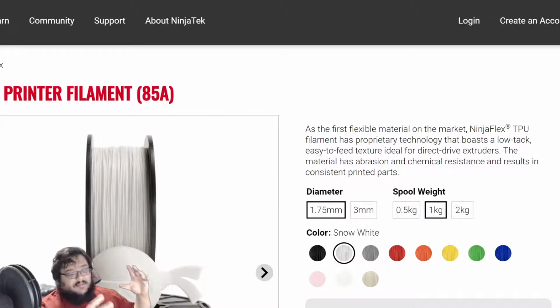I've basically designed my mold more or less as if it was going to be injection molded. There's certain things like draft angles and such that I didn't really implement that may make the idea of using an ABS mold more viable. That being said, I have not done so. It took me a while to come up with the three-piece mold as it is, but it is making some progress, and the goal is to be able to somewhat on scale mass produce something that I print a lot of.